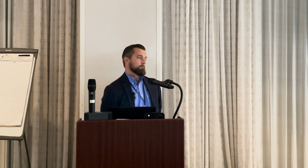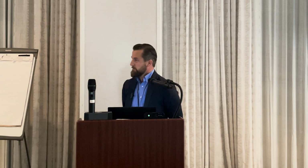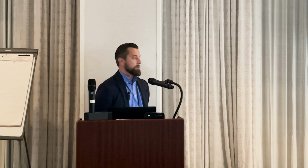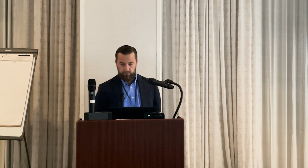Half the pressure? Well, okay, if you're operating at 100 psi, maybe that's only good to 50 psi now. Half the stress? Well, what allowable did you assume when you did your pipe stress with those joints? Did you assume 2,000? Well, maybe 1,000 would have been a lot more realistic if you're having a joint that's only 50% reliable. So generally speaking, we don't like shiny. Only if it's a finished product, we like shiny in FRP. But when we're doing joints, we want rough, we want torn fibers, we want to scuff the surface.